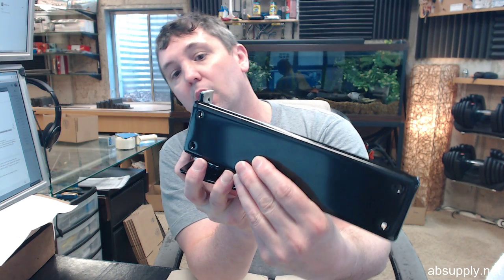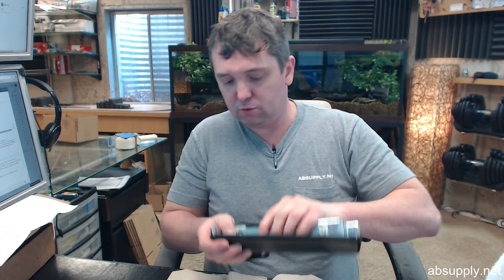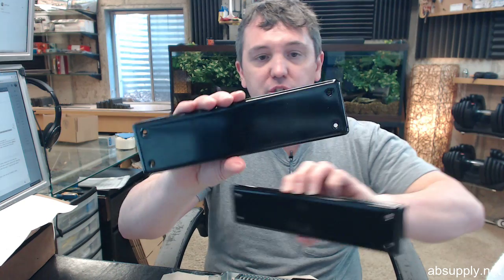So your heel plate, then your face plates, and I was about to say my one issue with the hardware. I was putting that together wrong. That's going to cover that, so you get a nice clean fit over the edge. I don't have it exactly positioned correct naturally. Okay, but the face plates have 4 holes each, and you don't need 4 holes each. You need only the top 2, but they obviously do that so that there's not left and right plates. So top holes only in the plates is what you'll do. So you'll have these holes that are unfilled. That would be my one and only reservation about the piece of hardware.